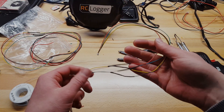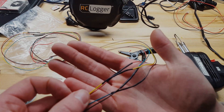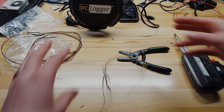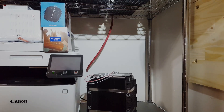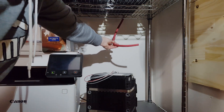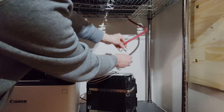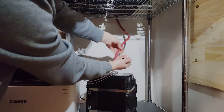We got these all done — you can see the heat shrink is on there and we've switched the black and green, so we're ready to put these on and start moving our modules into position. I have my positive wire mocked up for right now and it looks like it's going to be long enough. I need to put a lug on here still, and that will connect to these two fuses, which are going to split out to our two battery strings. I'm going to go ahead and put a cable lug on this.